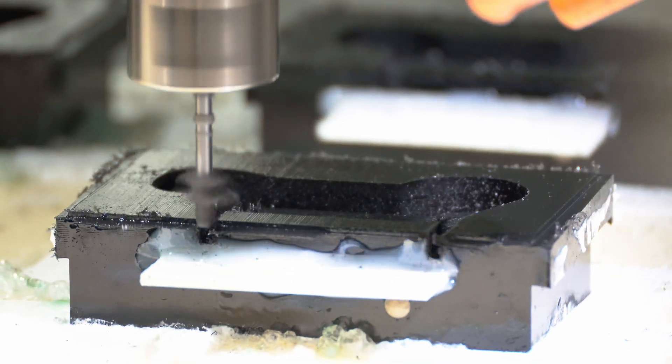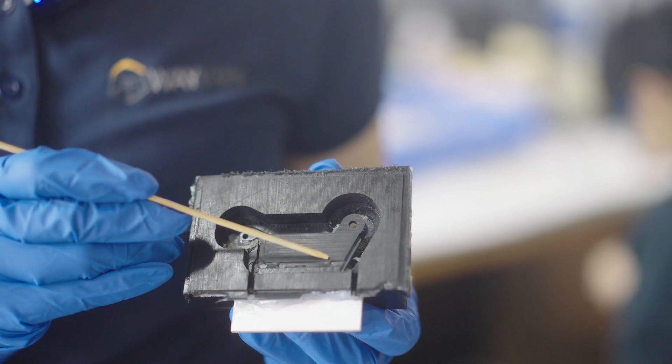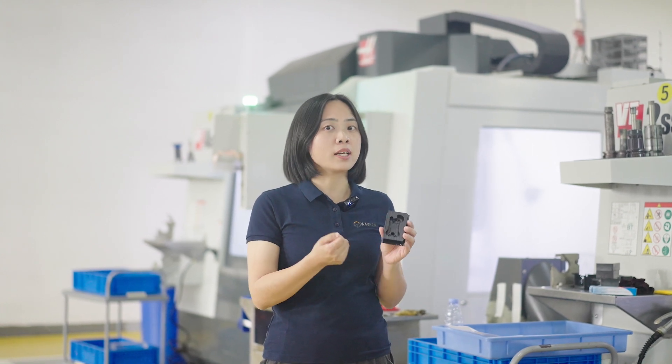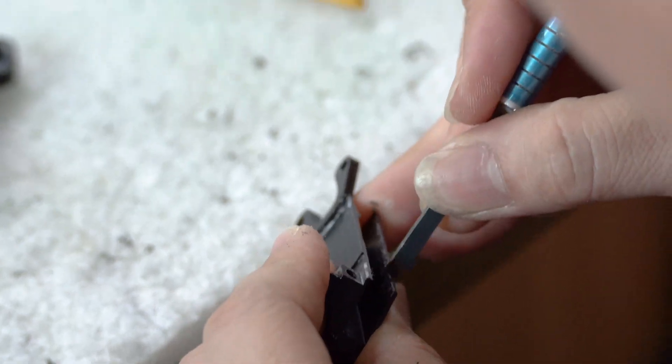So we should leave a few bridges — or "bones" — like these between side A and side B during machining to ensure tolerance. Otherwise, the external tension from the board, which was supposed to give support against the cutting force, will push side B away and affect the tolerance. We can always manually remove these bones later.